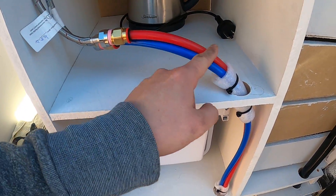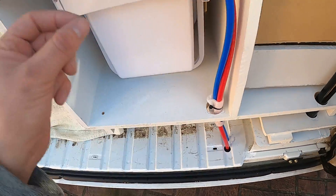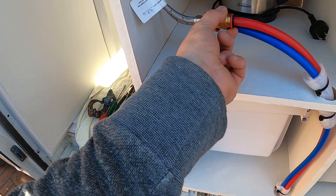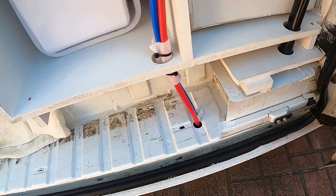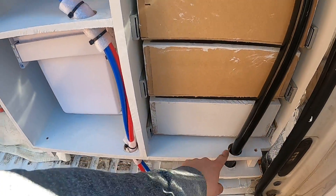The thing I like about this is that you can use the natural flow of the pipe — it's plastic — so that way you do fewer joins and you've got less chance of having leaks. This is one piece; it goes all the way underneath until I connected it. Same thing here — this is one piece.